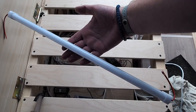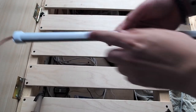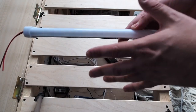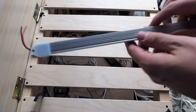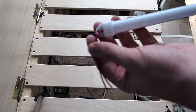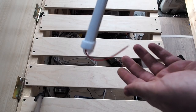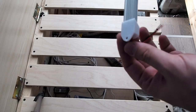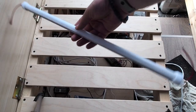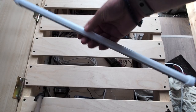For the light source I chose these 50 cm 12V LED lights, with a light strip inside and a matte finish to diffuse the light and make this soft lighting around. It has an aluminium profile, very light, and easy connection with two wires on each side. You can choose any of the sides to connect, and there are small holes for screws on each side too. It's super simple and super cheap — about $2-3 for each lamp.